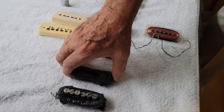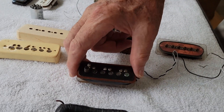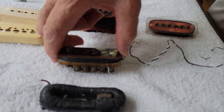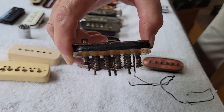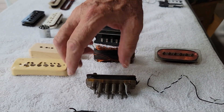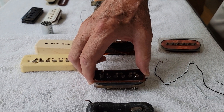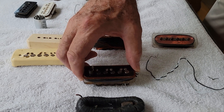He used this on the first gold tops as well. Coming up is the De-Armond pickup — he kind of liked it but didn't like the way it responded on the bass side; he didn't think it was clear enough. So what he did was take the original winding off the bobbin of this De-Armond pickup and rewound it with 24 gauge wire. The difference was he could only get 150 turns on that, so the level wasn't as high, but it was clear and clean and he could plug directly into his amplifier and get a beautiful sound. It was later used on his first gold top.